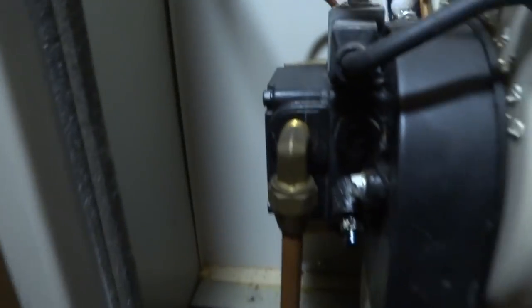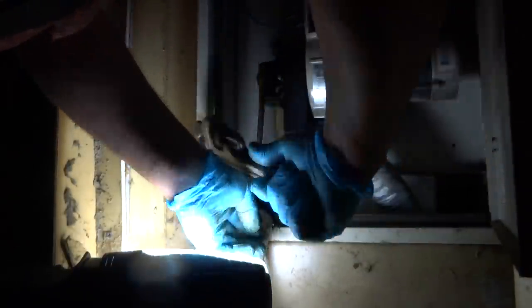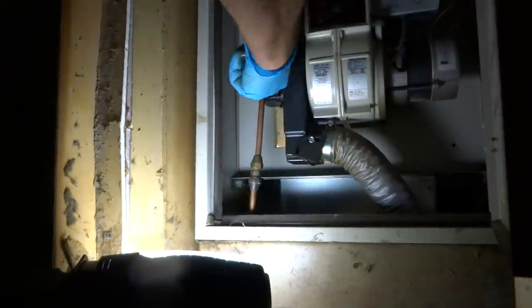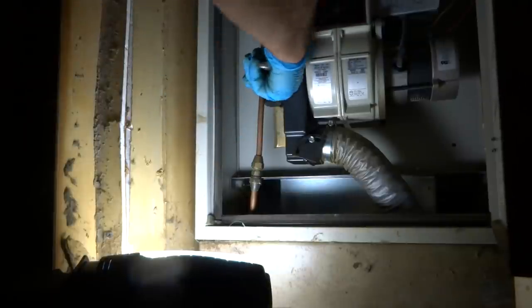You got it off on the thermostat? No fire-o-matic — that's no good. I'm going to put a fire-o-matic and bring a new oil line through. I'm going to show you what I'm going to do here — it's no good like that, legally. I'm going to cut this copper out of here because I've got to bring a new piece up anyway.